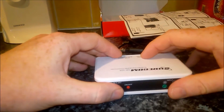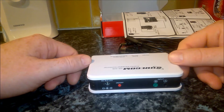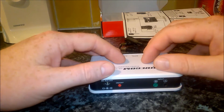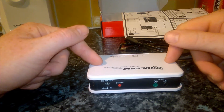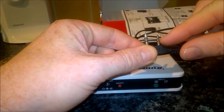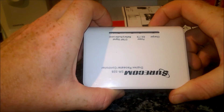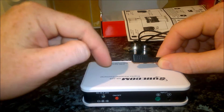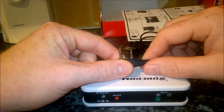Unlike other setups where you go lead-to-lead between radios and use a VOX facility — which is terrible, voice-activated keying that dekeys the moment someone pauses — this controller actually detects the incoming audio level from the receive radio and uses the push-to-talk line to key up the transmit radio. So there's none of that temperamental VOX behaviour; it properly controls PTT via the lead as well as passing audio.